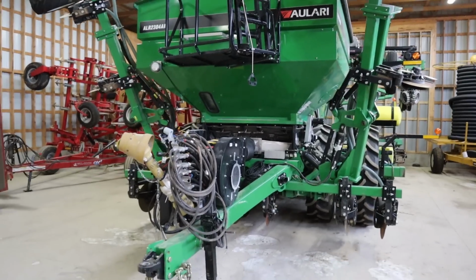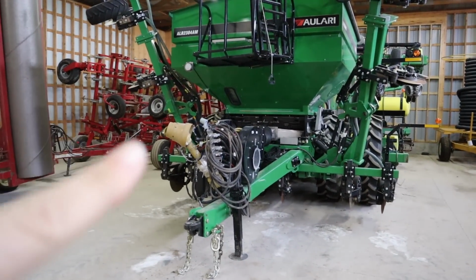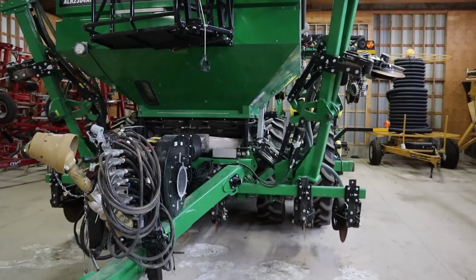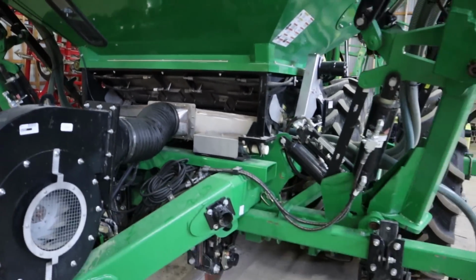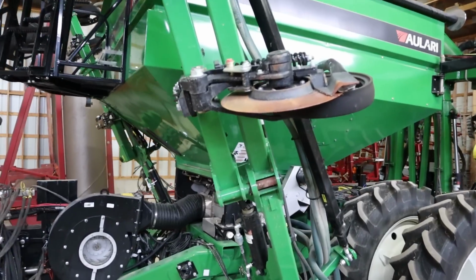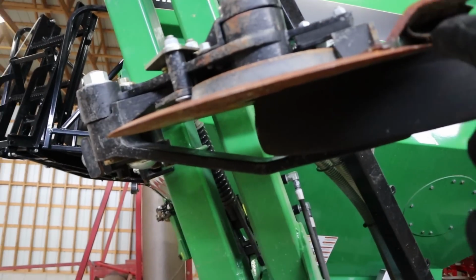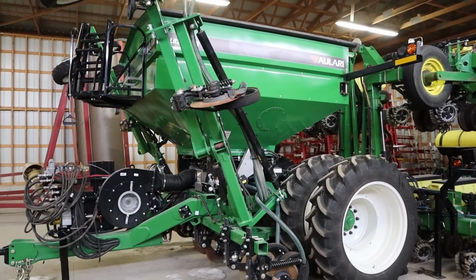And we also side dressed with the cart. So it's about a 5 or 6 ton cart. Those bars fold down, and it's got fertilizer in the front here that's metered out through the system here that's all hydraulically driven. And it's got 4 shutoffs in it. I think I probably have a video on this that maybe explains it more. Those are what an opener looks like. And the fertilizer blows out this hole here. It's been a good unit. I've been very happy with it.